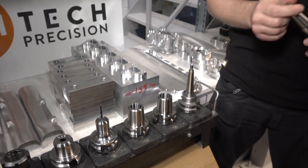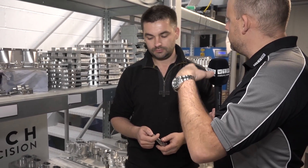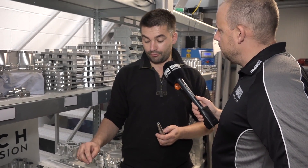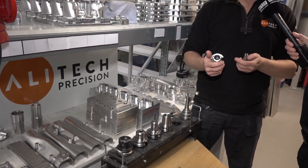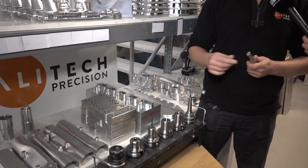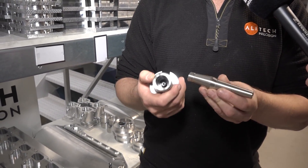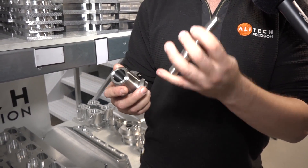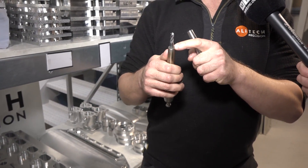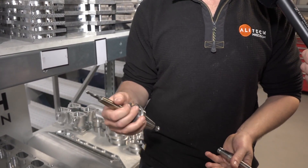What's the advantage with the heat shrink solution - is it runout, longer reach? A bit of both really. The runout is incredibly good - I would say as good as the WNT, possibly a little bit better; you're talking microns. But it is primarily for reach down into deep pockets. These are MST, done through Mitsubishi. The two-piece design gives us more access to chop and change because we've got different gauge length back ends - we can swap out the front, with non-coolant and through-coolant versions - reducing the cost of holding tens of thousands of pounds worth of heat shrink tooling.